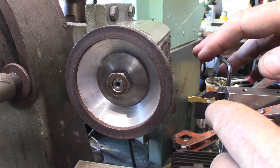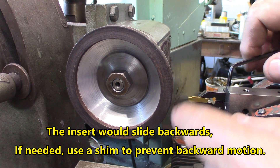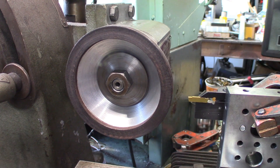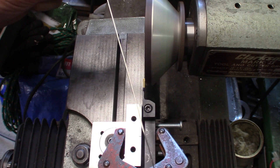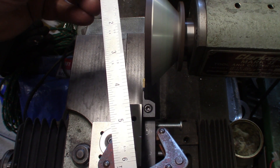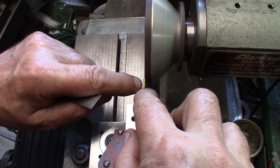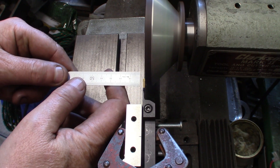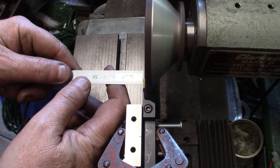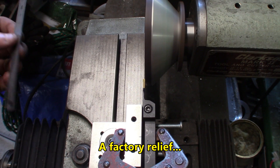Not setting the holder in the bottom of the slot is not meant for heavy removal or heavy stuff. Make sure that this is very solid. Now that it is, we'll start the grinder. With this top view we see that we're almost there. I exaggerate with the ruler there — I give it a little angle this direction to make a little recess behind the head of the cutter. This will help prevent the sides of the cutter from rubbing. This side here, which I'm going to do only one side, is already arranged for a slight relief angle.